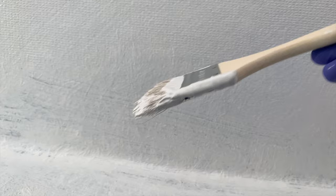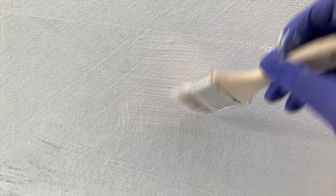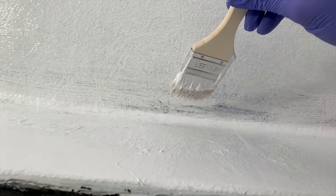What I wanted to show you: if I get a whole bunch of gel coat on my brush and lay it up right here, you can see how it doesn't sag and it doesn't drip — it just kind of holds in there. There's no sagging. You can see that we didn't quite get a spot there, but look how it filled all those holes in. Same thing right here — a lot of holes. I just push the brush and get some of that gel coat in there, and see, it fills the holes right in. It's kind of like a pre-fairing — getting all these gooblies in there.